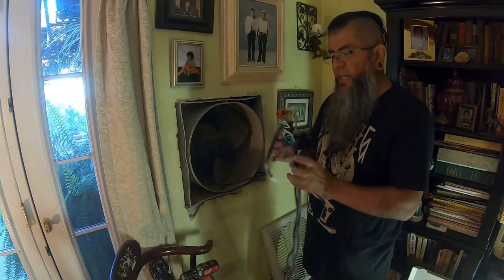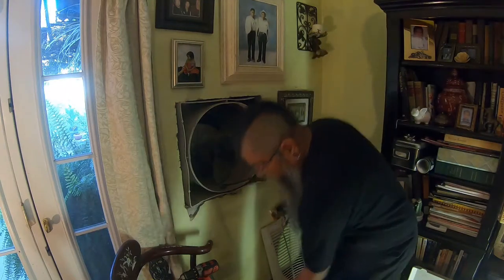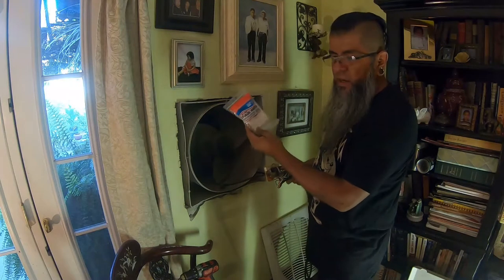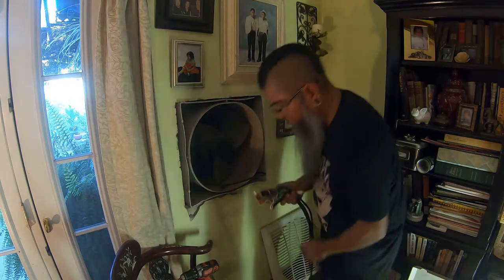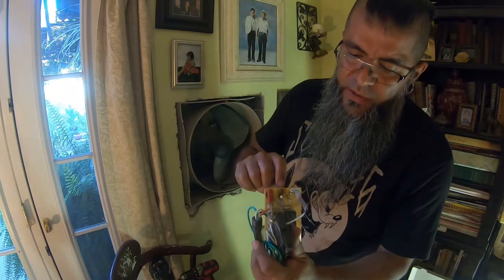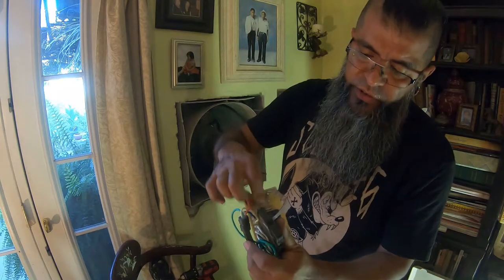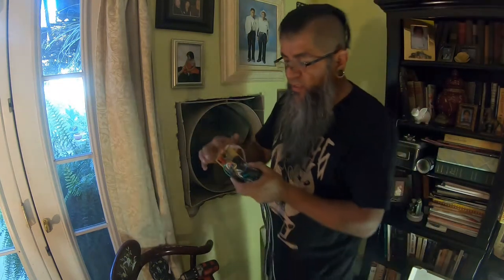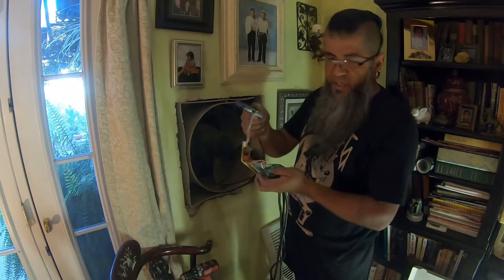This is what's faulty, this is what's messed up — and these cost 90 bucks anywhere you go, like $90–$92 or more plus tax, maybe shipping, you're looking at $100 for this piece. I could get the replacement switch for $13 and some change at Lowe's or a major box store. If you look carefully, these resistors are all burned right here — that's our problem. These little switches are messed up. It's easier to just swap it out and forget about the digital.